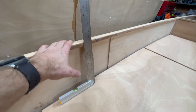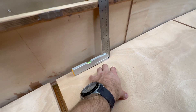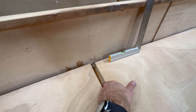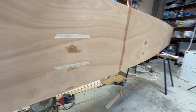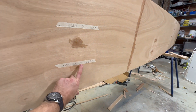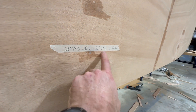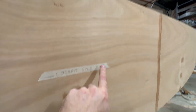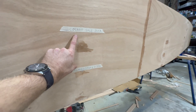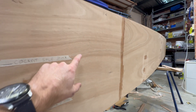From the sole of the cockpit to the upper edge of the hull side it's about 26cm, and about 24cm to the top of the hatch — so another 2cm down to the sole itself. Looking at relative cockpit sole to waterline positions, you can see the waterline there. At 350kg the design waterline is 20cm, and that's 20cm from here to the bottom of the masking tape. The cockpit sole is 26cm to that line there.